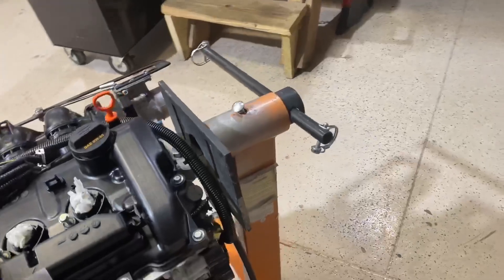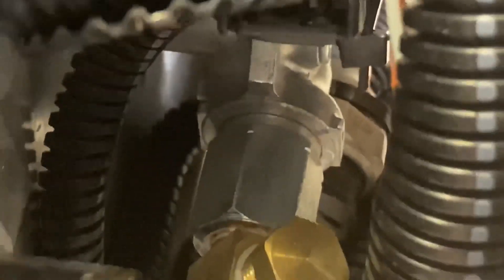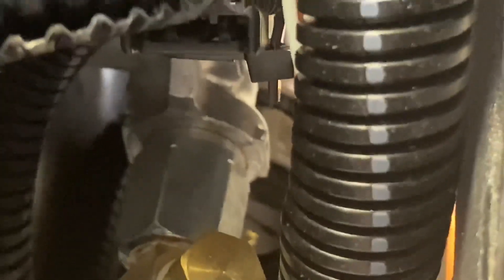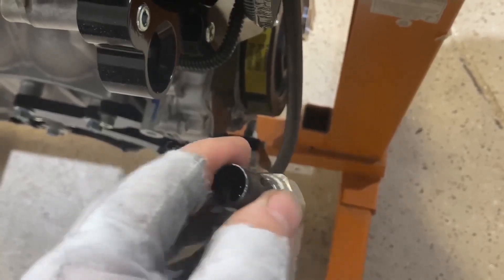On the back of the engine on the Viking 130 we're doing today, there's an angled brass fitting right there. Make sure you don't rotate the other fitting it's attached to, because it has a sealing washer and you don't want that to back out. You can remove this brass plug and screw your pressure transducer in there. There's one for oil and one for fuel — they're identical.